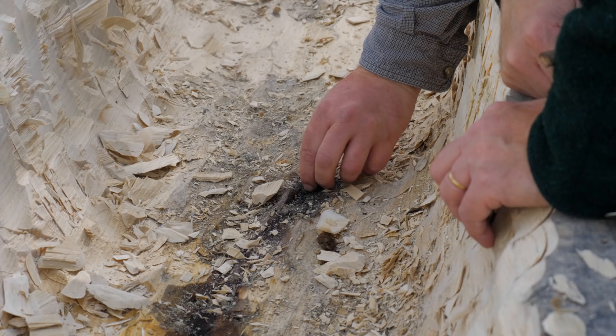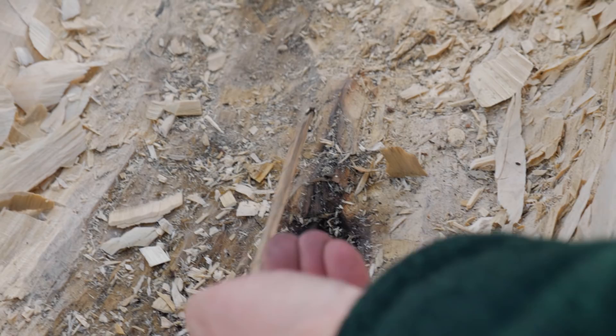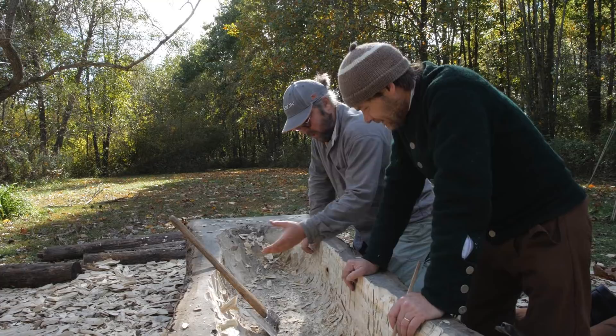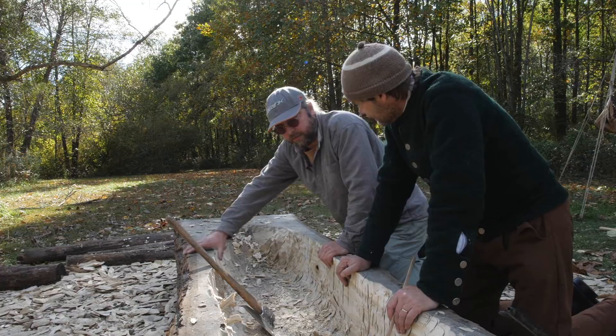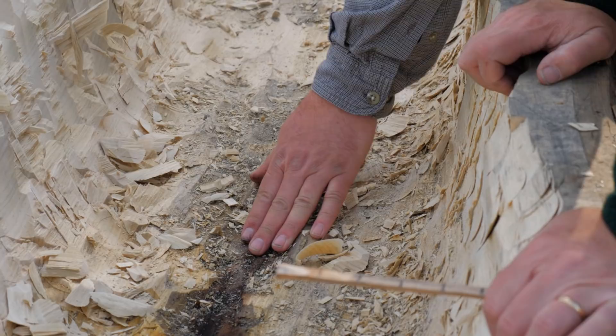We've got another issue here — there's a knot. How do we deal with this as we go through? Knots will leak because of the way the wood shrinks. I've been through this before. If you look at a lot of these old canoe artifacts, they have what are called thwarts — a thickened strip that goes across. They're placed pretty randomly, and there's a lot of speculation as to why. I think those are for knots. Basically, if you just leave about four inches thick on each side of the knot, you give yourself a lot more wood to help keep it sealed.